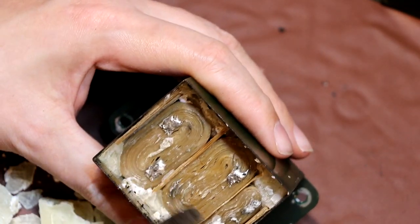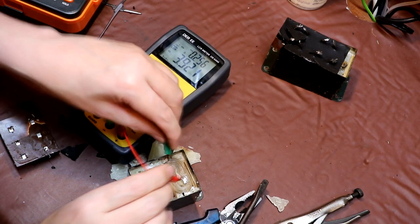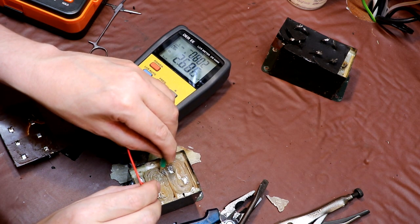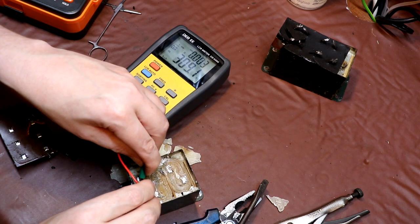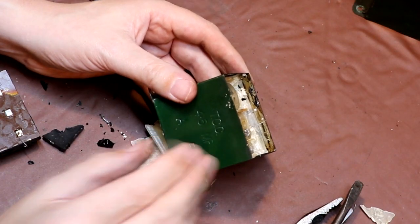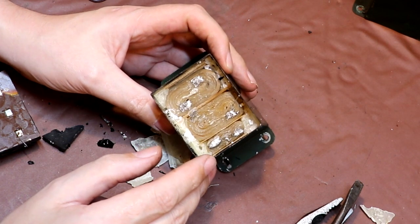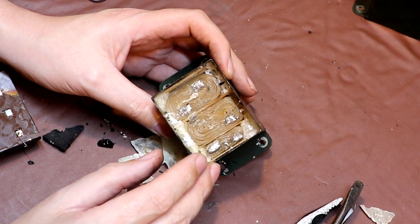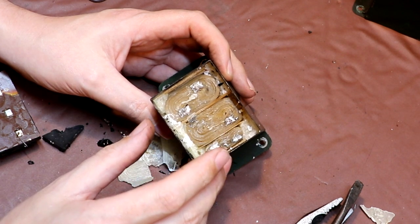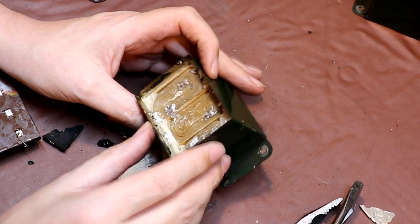I wonder if we can take another measurement, or if I've actually damaged this. Let's take another measurement. Yep, 4 microfarads, 4 microfarads, well, 3.5 microfarads, and about 0.8 microfarads. So I do wonder if these capacitors were always slightly over the capacitance value that was stated on the tin, or if they've actually gone high in value because they're starting to fail. Because that is one thing I have noticed, mainly with electrolytic capacitors, as they start to fail, they quite often go high in capacitance value. Now, I don't think these are electrolytic.